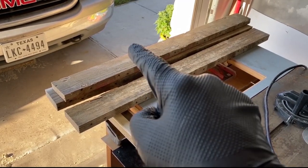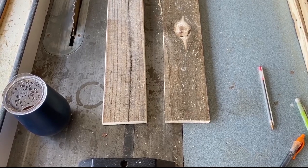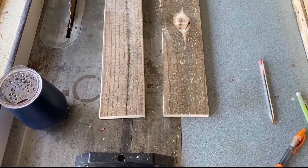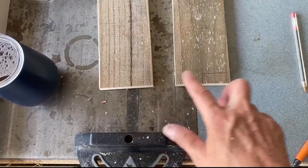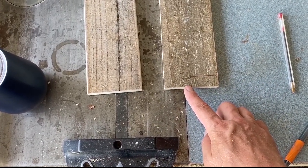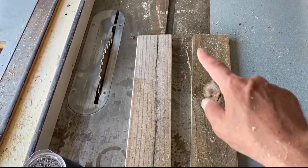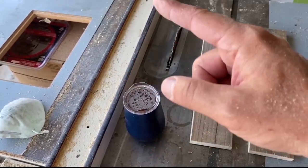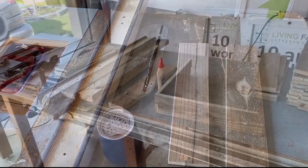The other two risers I'll use for the top. I've decided to use what are called half lap joints for this raised garden box — I just love them, they look very classy and clean, and they're very strong. To make them you find the thickness of the board — these are 5/8 inch thick — and the width, which is 3.5 inches, then find the center point at 1 and 3/4 inches. I've marked that off and I'm going to cut out the notch, then do the same kitty-corner for all 16 boards. I'll raise the blade to 5/8 inch, set the fence, stand the board on end, and keep sliding it back and forth until the material is removed.